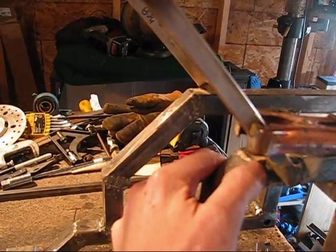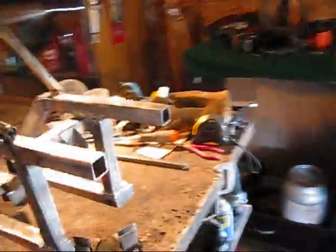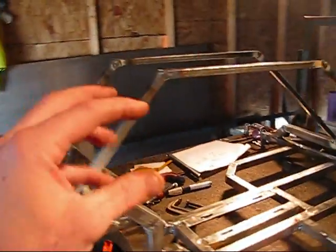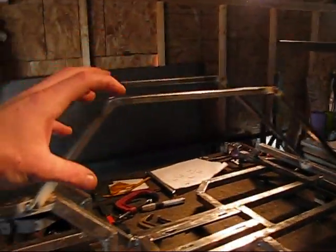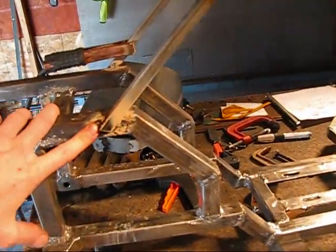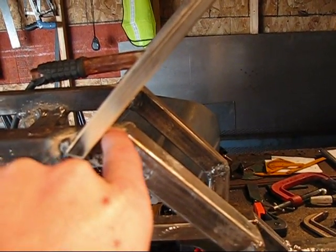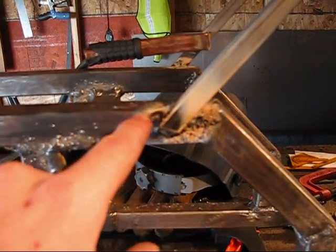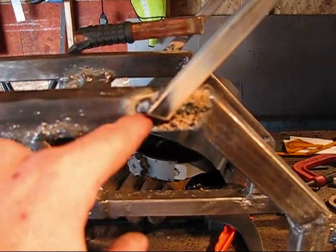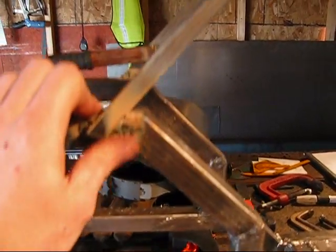The way it is now it's about half inch to five-eighths there. But this side over here was a little bit more difficult because I had to put all these clamps and stuff on this thing to make sure it was the right distance. I measured it, tried to get it about a half inch to five-eighths away from the corner here, and then the point would be halfway in between the steel. It didn't turn out as well as I thought, so I just had to weld it as is.